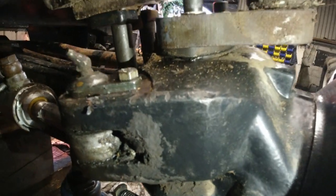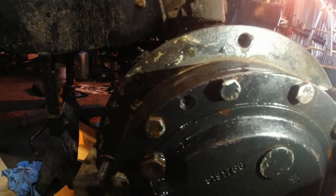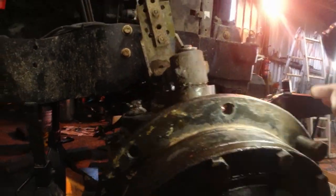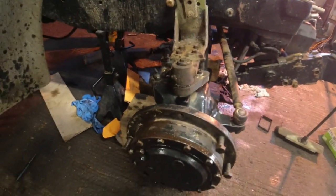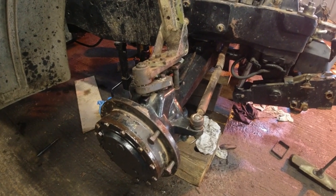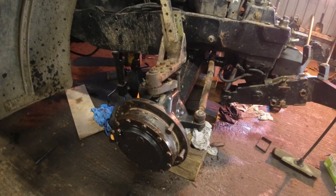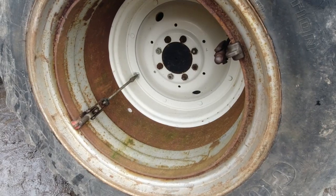We slipped in our axle, lifted it up, and once we got a few bolts in it, it was held and made life a bit easier. When we were taking it apart we split the outer hub, took out the two kingpins and slid out the hub. Trying to line it all back up wasn't too easy — even with the block and tackle holding the weight of the hub from the roof, we ended up just pushing through the shaft, and once the shaft was in we put our hub back together. All in all, not too bad — just an evening's work really. Absolutely delighted that is finished. What we'll be doing today is tightening her all up, and we will be fitting a set of dual wheels.